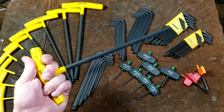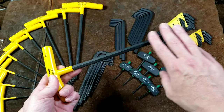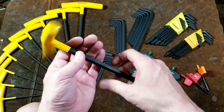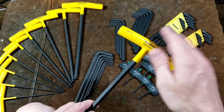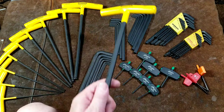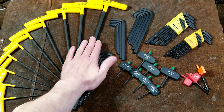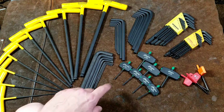What's always kind of disappointed me is just how long they are. The 3/8 one is over a foot long, so it gives you a nice reach — and it is hard to find Allen wrenches with that kind of extended length. They also advertise the high mass of the handle: once you get the fastener broken, you can spin it and the inertia keeps the fastener spinning. They can even be used as a hammer — not recommended — but at a foot long with a heavy curved head, it would always hit at the same point. I've seen these used to hit the heads of hex fasteners to upset the threads so you can remove them.